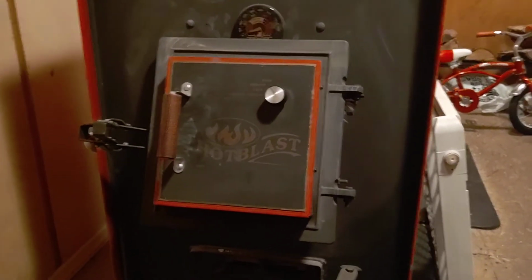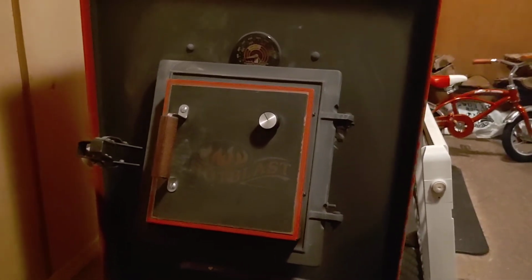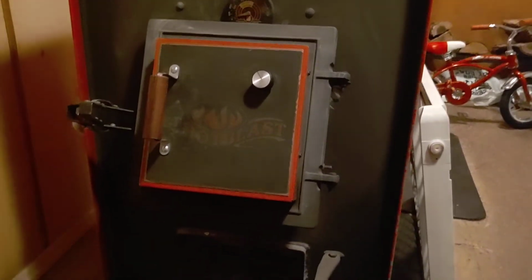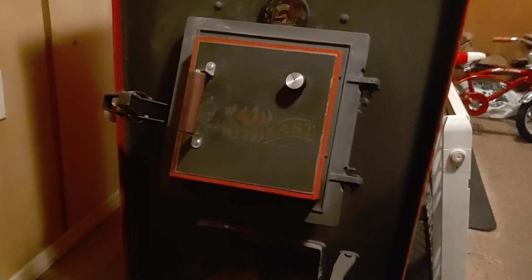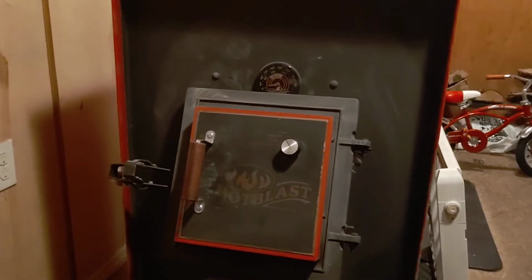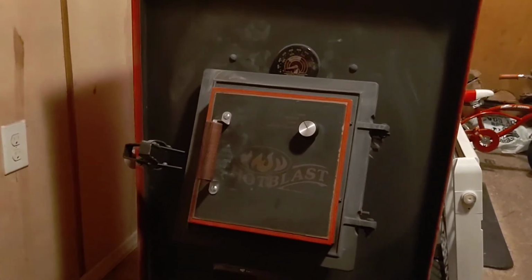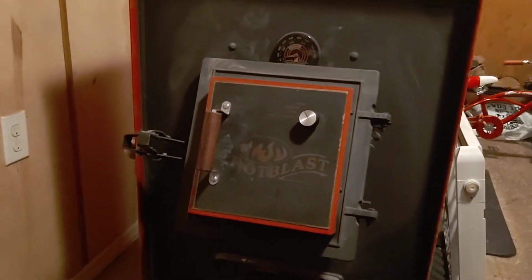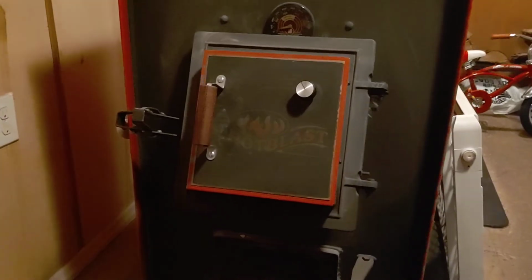But in them, the way they're designed, it's like a dump. It's more of a bucket shape. Even if they're a square type, they have a place where you pile the coal in. It's piled in no more than 10 to 12 inches of a box, and no wider than 18 inches or so. It piles in, and it's going to burn from the bottom up. It's going to burn pretty much nice and even.